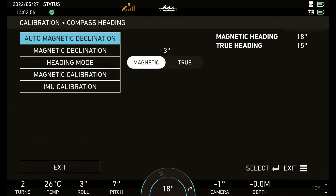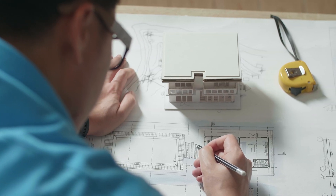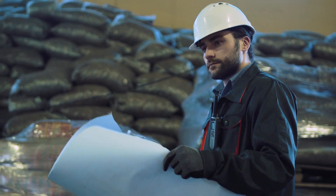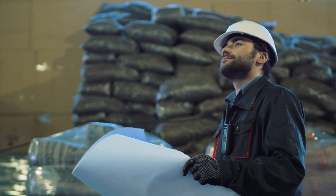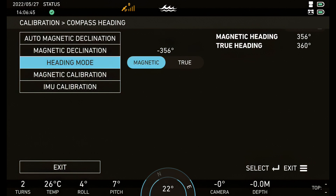There are a number of options available in this menu. Unlike nautical charts, architectural plans are typically drawn with reference to true north, not magnetic north. If you are operating the ROV in a structure using architectural blueprints for reference, you can set a declination and change your readout from magnetic to true.